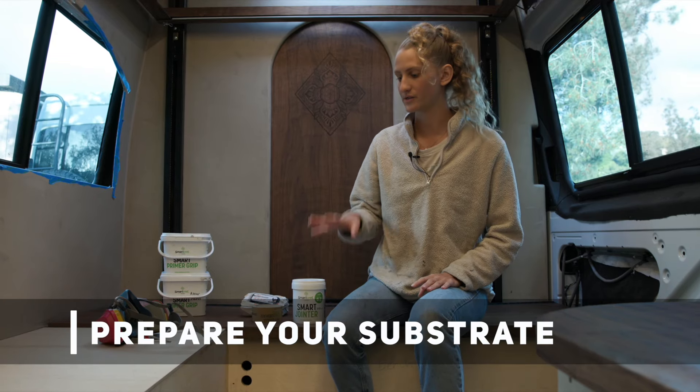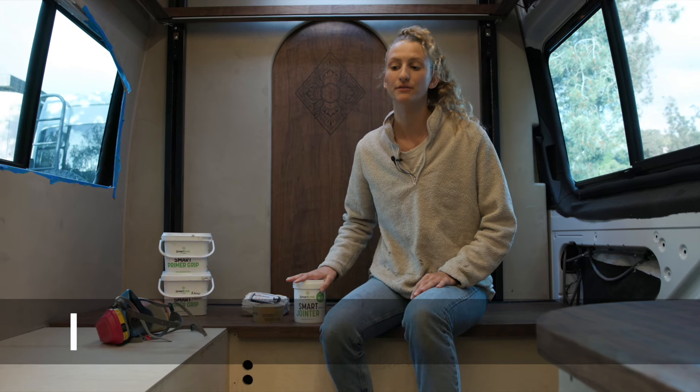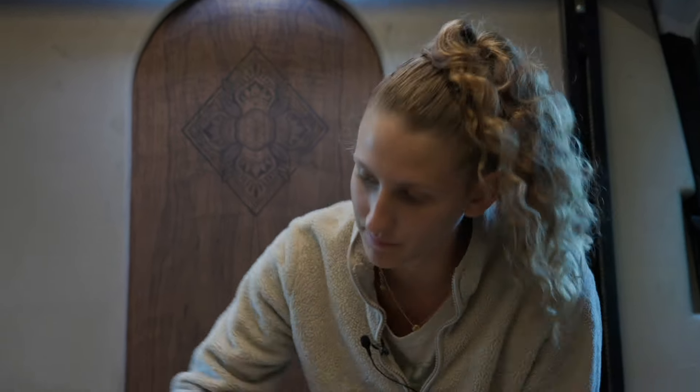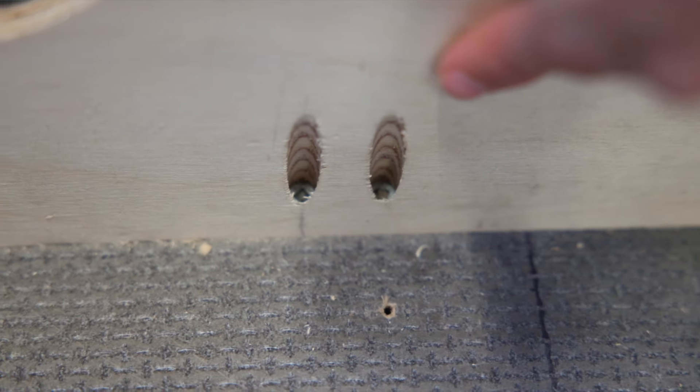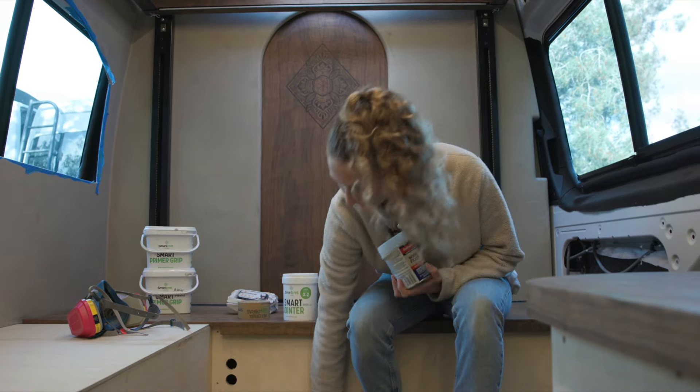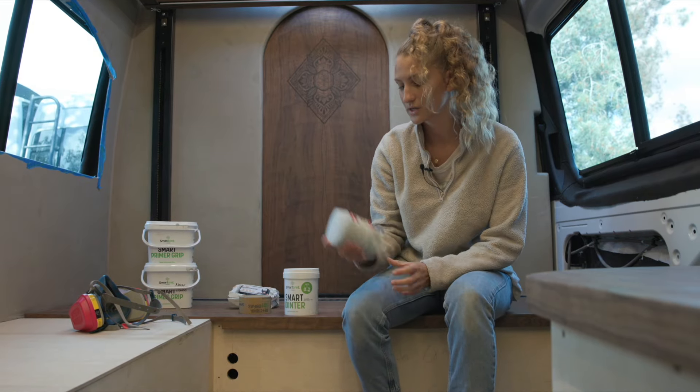The first thing in this process is to prepare your substrate layer, which is a really important part. If your substrate has joints — like where your wall and floor aren't actually connected — they need to be solidly one piece, because any flex between those pieces will cause your concrete to crack. The only way this product cracks is if your substrate below it cracks. They give you a SmartJointer for cracks two millimeters and smaller, but for larger gaps like deep pocket holes, I recommend buying wood filler — it has a hardening property that makes it tough and flush with the surface.